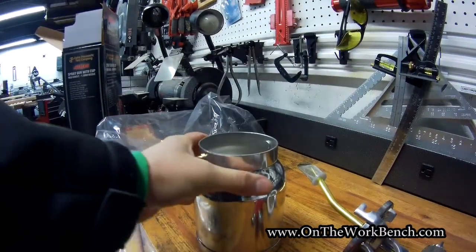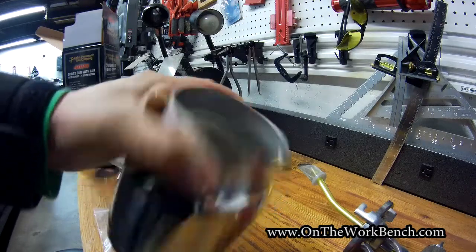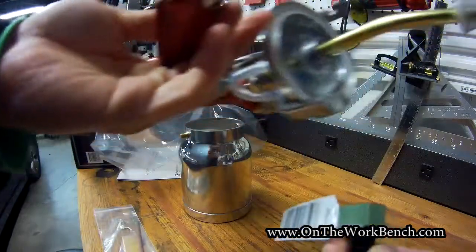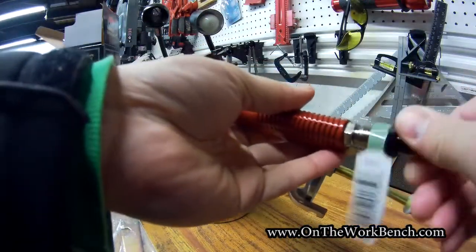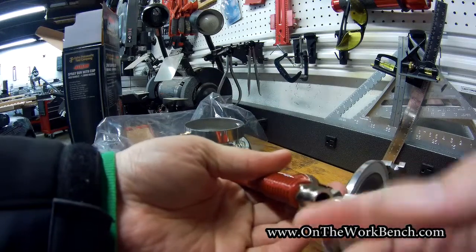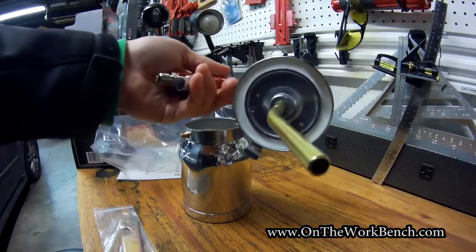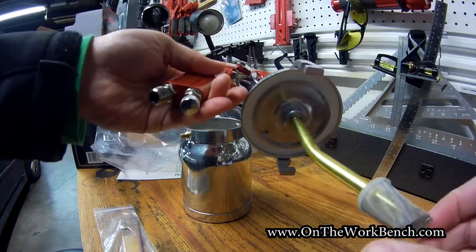At the very bottom is the paint cup — a metal paint cup with little brass tabs on either side. On the gun, the first thing you'll notice is there's actually no connection valve. To fix that, I've already bought a high-flow quarter-inch NPT nozzle that should thread on. I'm also surprised it doesn't come with a cover over the air inlet. At the bottom there is a removable strainer over the intake — it's an interesting filter, though kind of sharp on the edges.